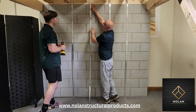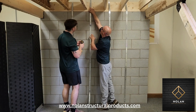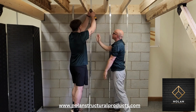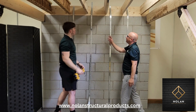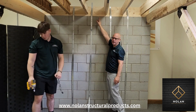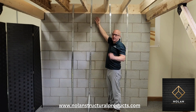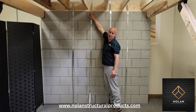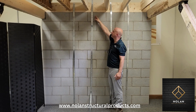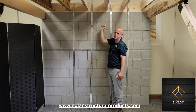The final step is to bend the strap over and secure it to the rim board, then cut the excess off at the top. If your wall is not tipping in at the top, it's not absolutely necessary to do that step — you could cut the strap off there. But for extra added protection, you would just screw it to the rim board.